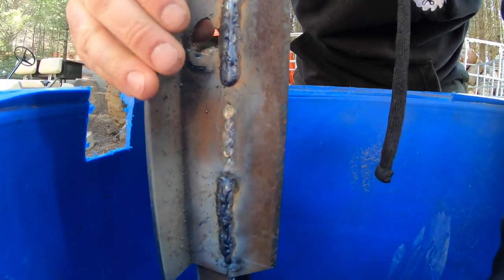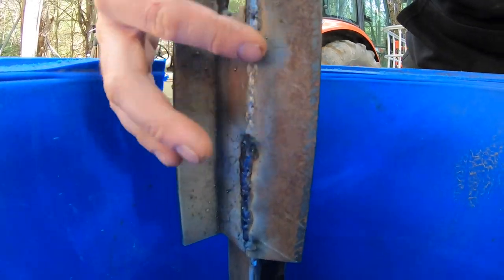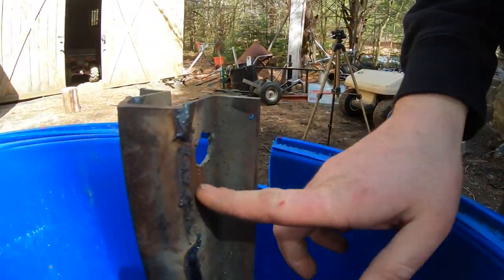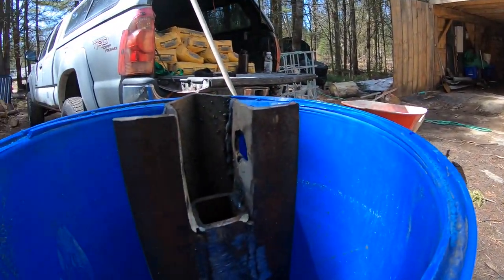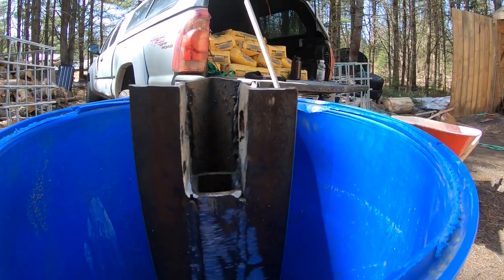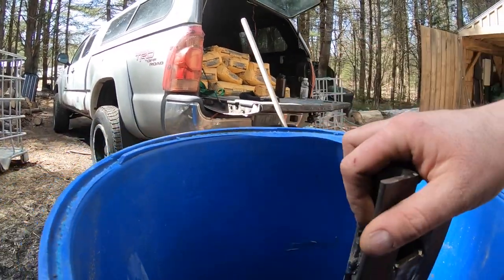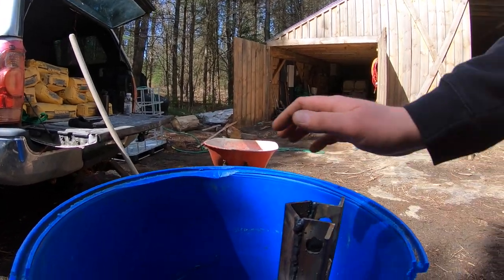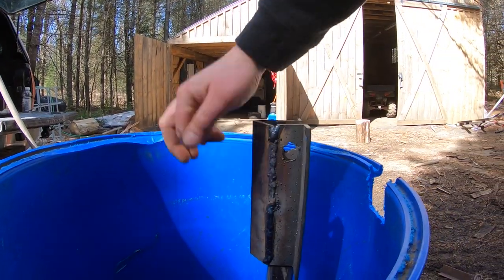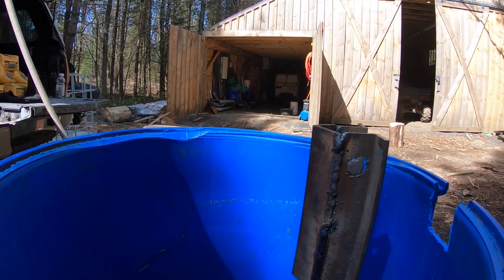And in order to stiffen this up even further, I put this extra piece of angle which welds down both sides of the angle and sort of holds it together, and as you guys can see, creates a bit of a hollow there for the top link to slide into. So really a solid unit there. That's what's going to get filled in with concrete, and some of those welds I haven't even knocked the slag off, but that's as good as I can do for my welding anyways.